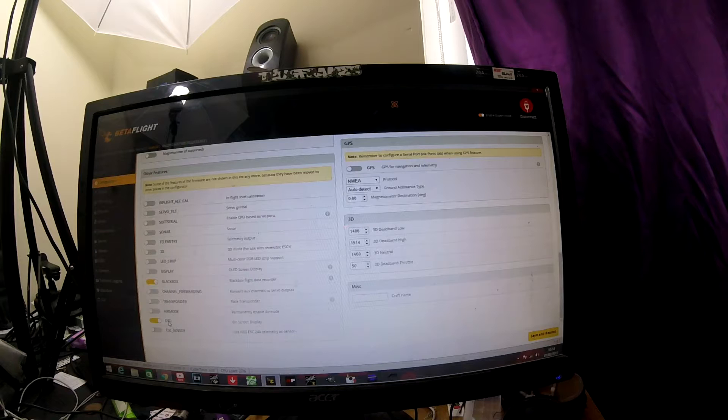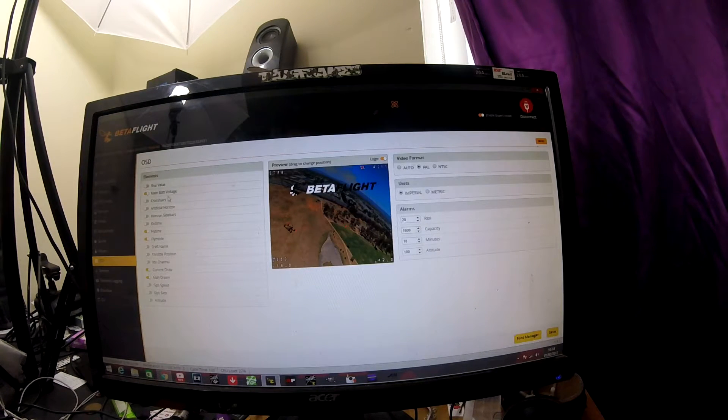Also your OSD - let me show you the OSD page. No matter if you're using expert mode or not, you can still get into the OSD. You click on OSD over here, and then you can select what it is you want to see on your screen. On mine I have my main battery voltage down there. I've also got the flight time. There's the on time and the flight time - the on time is from when you first plug the quad in, it will start counting up so you can see how long it's been turned on for.